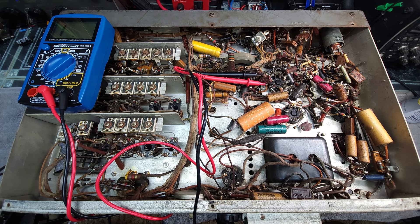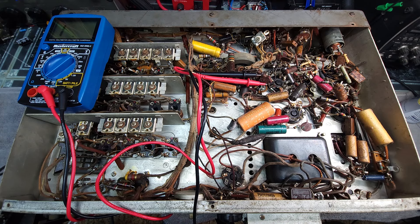The radio is in rough shape. If it hadn't been for the IF transformer, I probably would have gone ahead and restored it. I'm going to need a selectivity switch, but I think I can repair that one — I've got enough similar switches around. I can take a contact off one and use a little watch-grade nut and bolt to put a contact on the selectivity switch. That's not really a showstopper. But the IF transformer is a showstopper. I'll have to dig around on eBay and see what I can find.